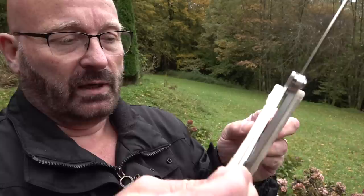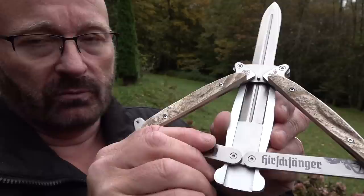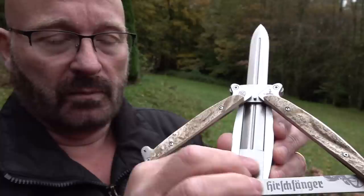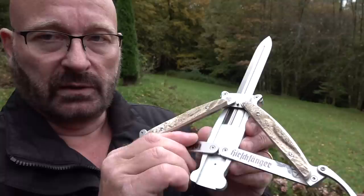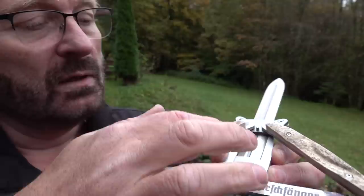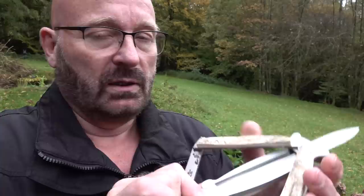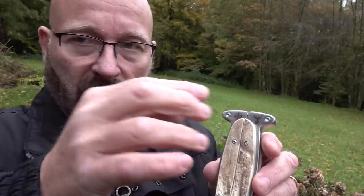But the biggest improvement is the synchronization. What I did is only the front part of the handle swings, not both parts. The rear part always stays solid and closed, and this enabled me to integrate this little rail system here, where this part of the blade that is not sharp is actually guided through the rails. So you can even do this on one side — it's not possible to cant this knife; you can't really cant the blade while opening and closing. Also important is this pin here, which is also found as a hole in the boards, in the metal parts. This makes it impossible for the handle parts to swing over to the other side — they can't because they lock against that pin. So synchronization is absolutely possible.